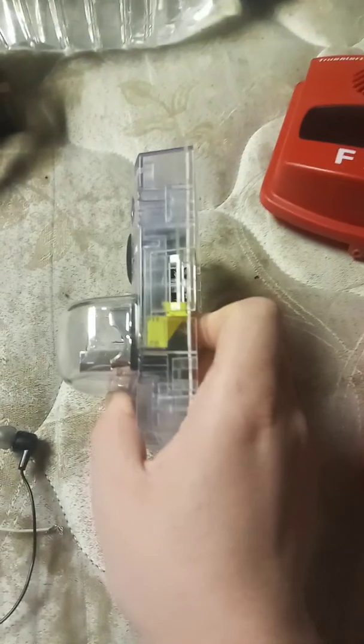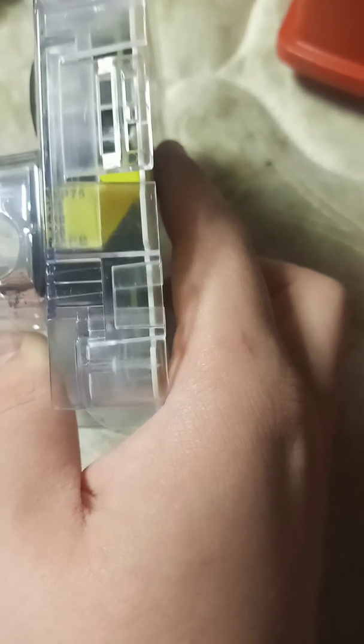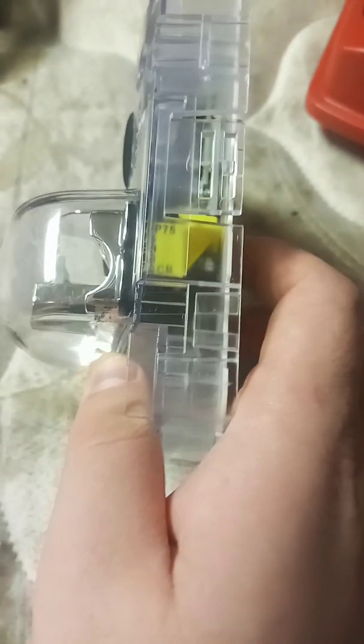And this one is a 4906 one, since it is multi-candela. Your options are 15/30, 15/60, 75, and weatherproof 75. Despite it saying FACP, that is not an option on this device. I found out there's no holes that allow you to control the candela, which is what the FACP stands for, from the fire alarm control panel.